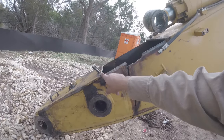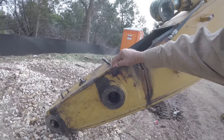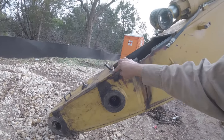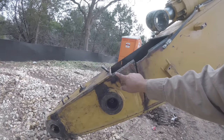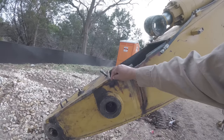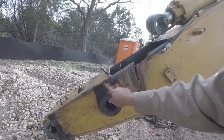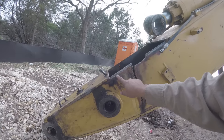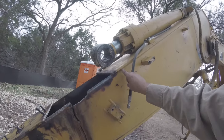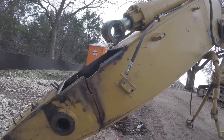And where these plates end here, I'm actually going to gouge further up to about here. So as I weld this, this will be a continual weld this way to kind of a little bit better strength instead of just a real sharp stress area. I don't know what you call that, but either way, that's what I do. Start by there, gouge it all up, make one continuous weld. Same thing pass here this way, and this will be filled in and backer plate like I mentioned earlier.